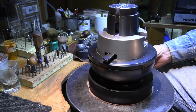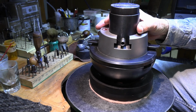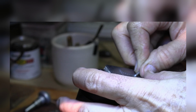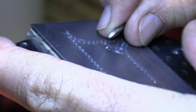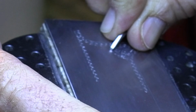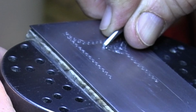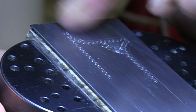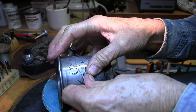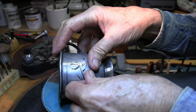The advent of a vise, such as the ball vise, enabled an even more reliable way of cutting. With a vise capable of being turned, the counterclockwise cut direction for a right-handed engraver was still more natural. However, experienced hand engravers developed the ability to cut both counterclockwise and clockwise, and even without a pivot thumb. In the example of the directions of cutting the A, it is obvious that the left-handed engraver would cut oppositely, in the clockwise direction, and use the left thumb as the pivot point and the right thumb to aid in preventing slipping.